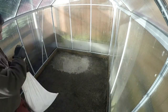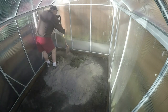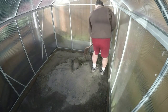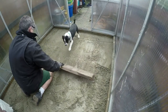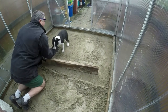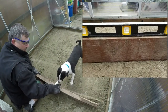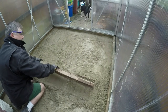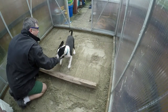With the dirt packed, we now want to apply a leveling compound — usually this is in the form of sand. The better job you did on leveling your ground, the less sand you'll need. In this case I'm adding enough sand so my pavers will be level with my 4 by 4 foundation of the greenhouse. Do a rough leveling with a rake, and for the final leveling grab a board that's as wide as your project. All the high and low spots become extremely obvious when you start dragging a board across sand, and the board provides a convenient place to set your level. Once you have it level, tamp it down the same way you did the dirt. If you're not in a hurry, the perfect way to compact sand is to get it wet — sprinkle it with the garden hose, then let it dry out.